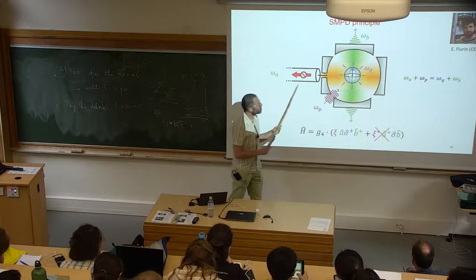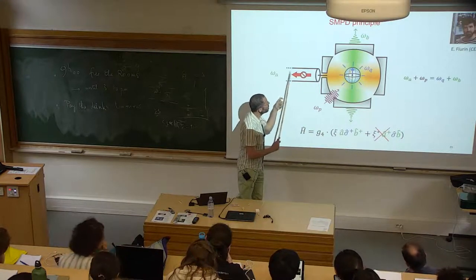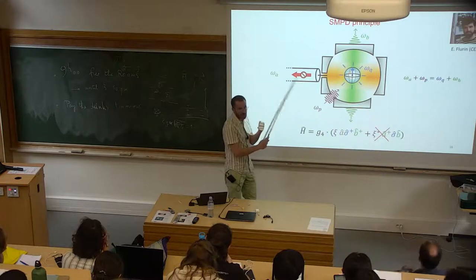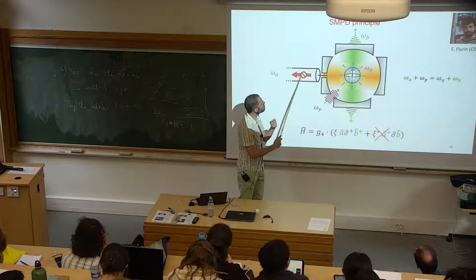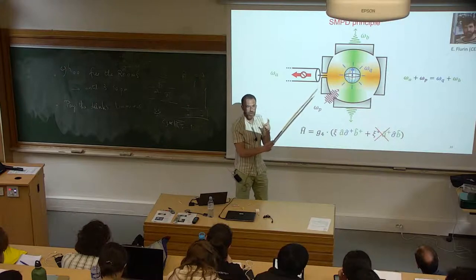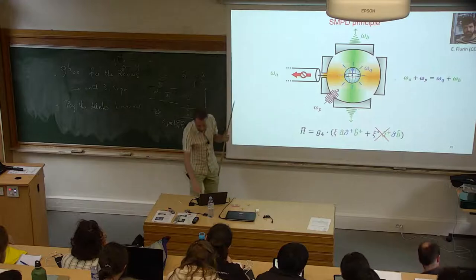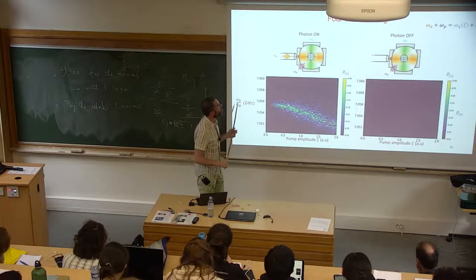So the idea, to summarize, is that we have an effective coupling between the transmission line here and the transmission line that goes out, that is parametrically pumped by the qubit, and if we match the coupling right, that can be 100% efficient. Each photon that arrives is converted at this frequency, but in doing this conversion there is a qubit excitation, and the qubit excitation is there forever. So then we have time to read it out. Okay, it sounds a bit crazy, but it works very well, because qubits work really well. That's the message.